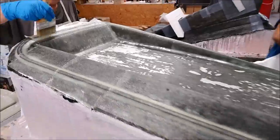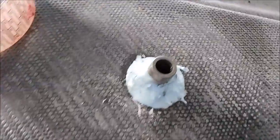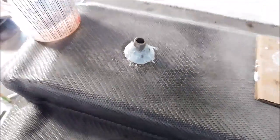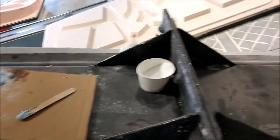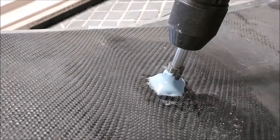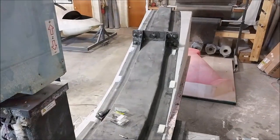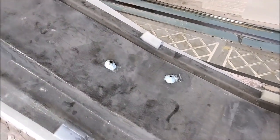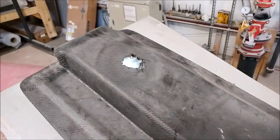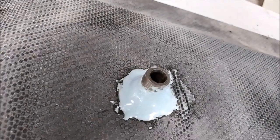Here Jeff and I are using the CNC machine to align the bushings for the drill holes — these are the bolt holes that hold the main spar to the wing spar. We're putting these half-inch bushings in place so once that part is laid up we can just run the drill through there to create the pilot holes. There are also a couple of holes for the top mounting points for the retraction mechanism for the main landing gear.